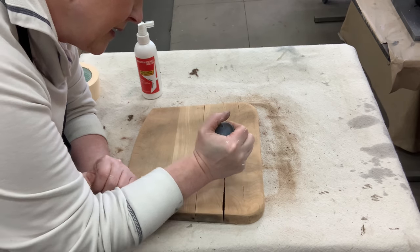This is a glass cutting tool, so he made his marks, he's got a ruler, and now he's just going to go in and make a couple score lines to score the mirror. I don't want just those glazing points to be on the back of the mirror, so he's cutting off a piece of cardboard to give it a little bit of cushion when putting it back into the frame. We'll replace the hanging system so that it's good and strong.